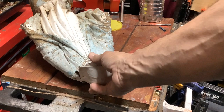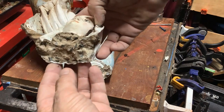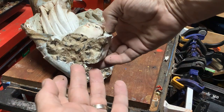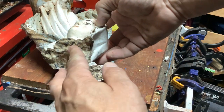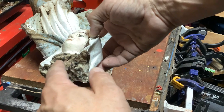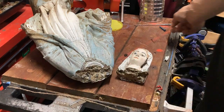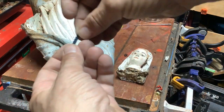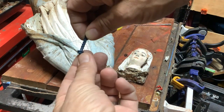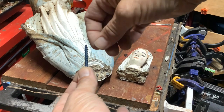I was thinking about how to fix this and I reached out to a scout crafter who's usually good at coming up with solutions to strange repairs. We had sort of the same idea - he suggested a mechanical repair like a fastener or pin into the head, then drill out a hole, put the pin in, and cement it. What I came up with was to use a small tapcon. The tapcon has the bigger head, which we can put into the body - drill a bigger hole, fill it in with cement or mortar, then screw the tapcon into the head.